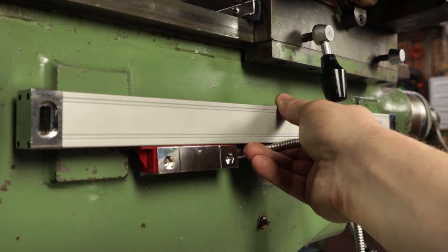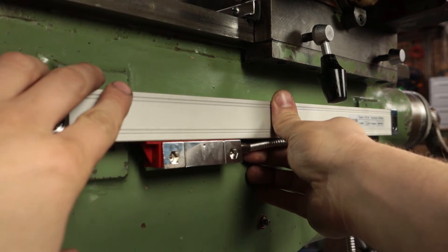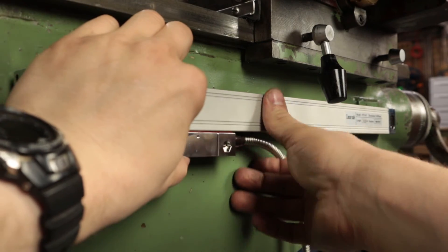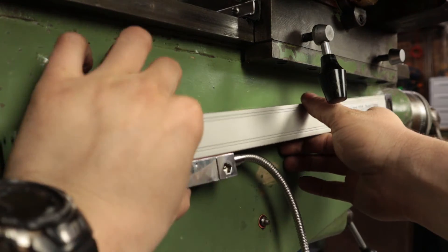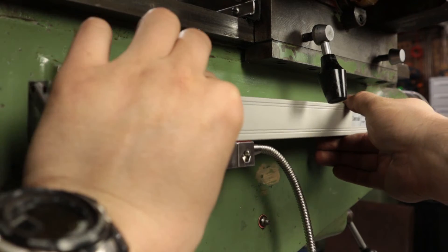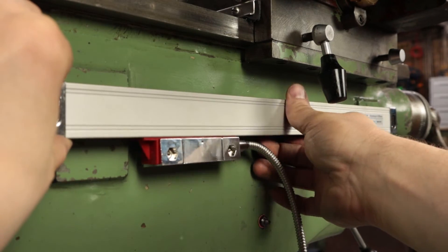That surface is nothing like flat, so I've also got to make sure everything's nicely aligned. The way I did the other one was with some vertical slots and some horizontal slots, which fixes two of the axes. Using the two slots in one direction I can correct for any out-of-parallel in that direction, and using the two slots the other way I can correct for the other direction — but the one area where I'm stuck is if there's any out-of-parallel in the third direction, though I've got an idea.